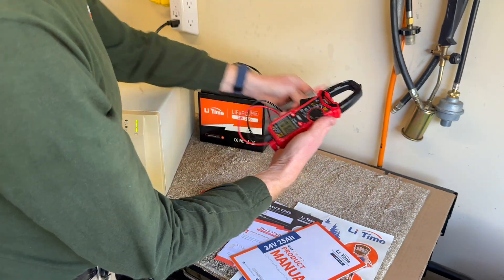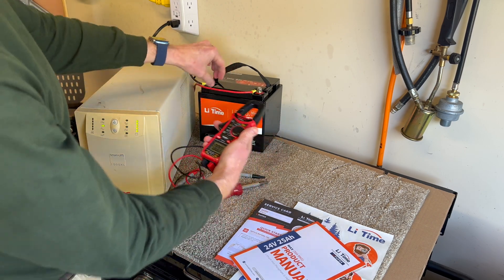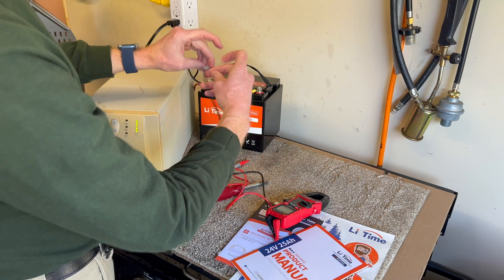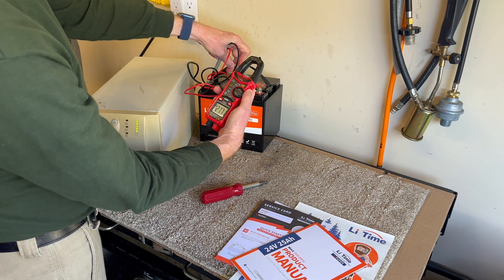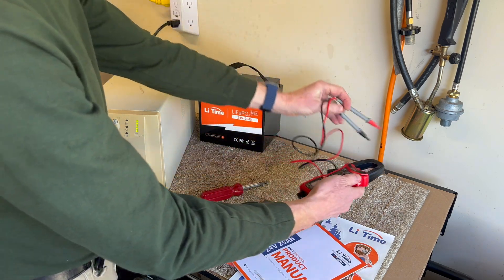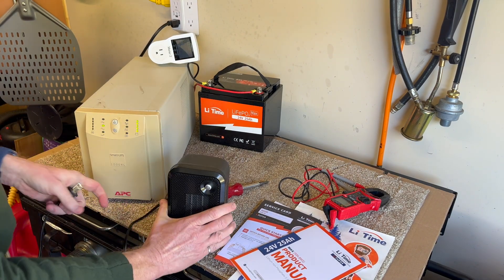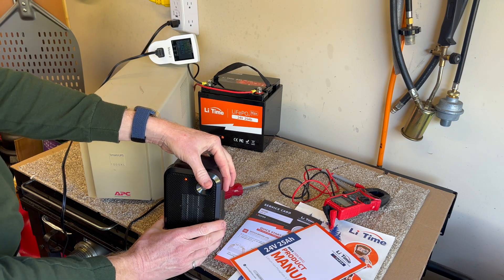We're online. Is it charging or discharging? It'll be charging — let me zero the clamp meter. We are charging the battery at 0.3 amps. The UPS will float at 27.5 volts, which is very nice. We're showing 27.71 volts, so the battery is coasting down a little from where I had it on the power supply, which is fine. I've got my power meter and my all-purpose 500 watt load bank — we'll get that going.